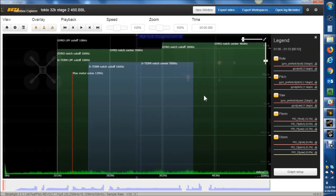So the first log you sent me, the first thing I noticed was that the sampling rate was one kilohertz, because then you were getting in your spectrum analyzer only up to 500 hertz. My opinion is that with 32K sampling and 16K PID loop, that one kilohertz sample rate is not high enough — you really need to get up to, I would say, eight kilohertz as my preference.